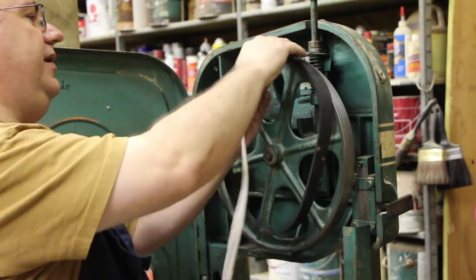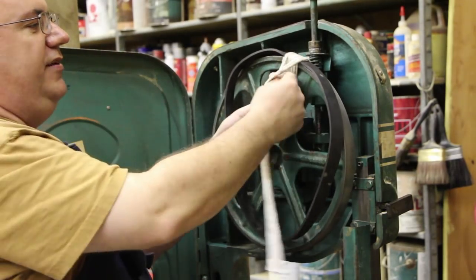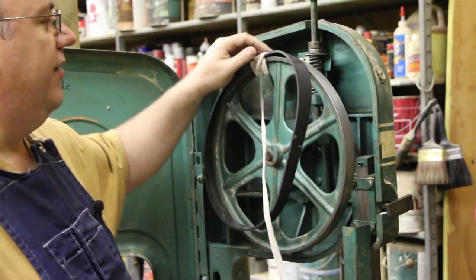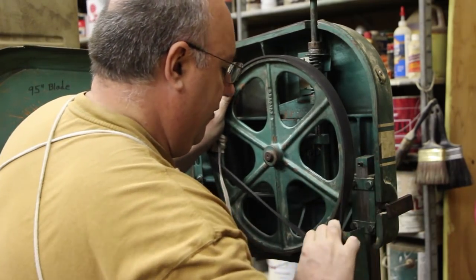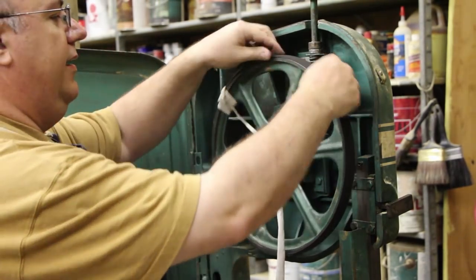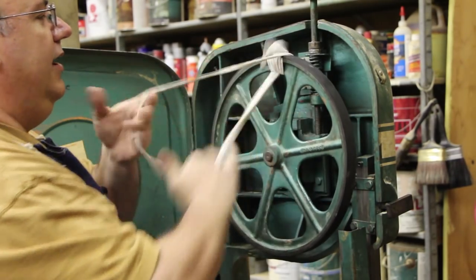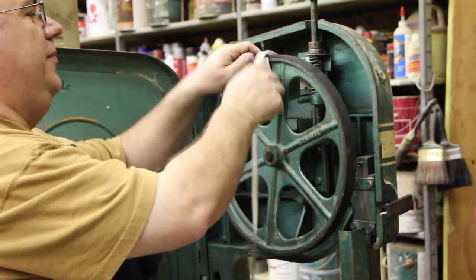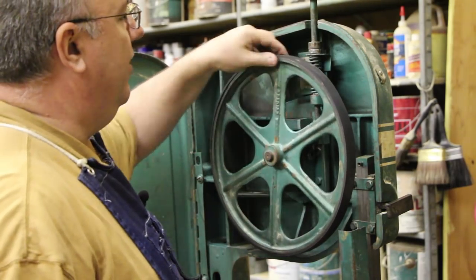You can use a piece of rubber or any kind of flat material — you want to wrap that around there a couple of times. What this is going to do is basically just hold that tire in place long enough for us to stretch it onto the wheel. I'm just going to tie it off here. So that should hold that in place right there. And now I'm just going to take it and pull on it and stretch it around until I get this tire on. There we go — that simple. The tire is on and I can kind of just center it up on the wheel now. Then we'll just remove this piece right here. The tire stretches real easily and we can get it out without any problem at all — just pick it up and boom, it's off. So that tire is on and we're just about ready to start the gluing process.